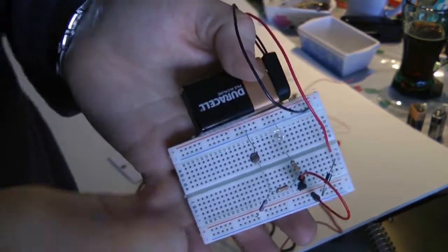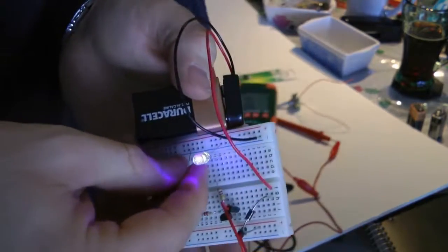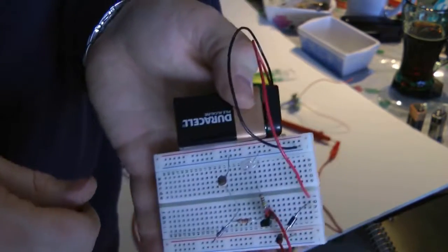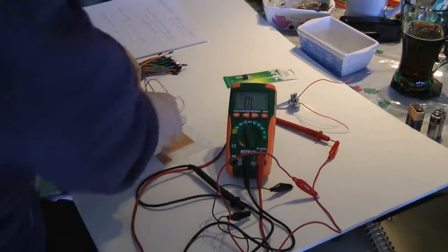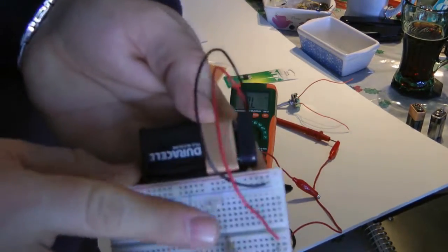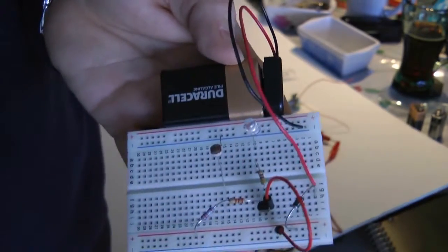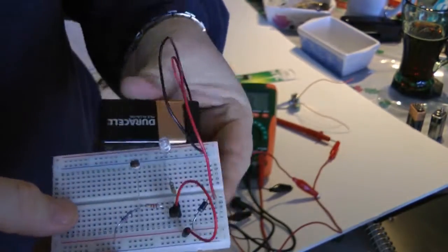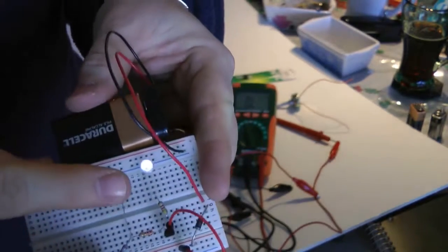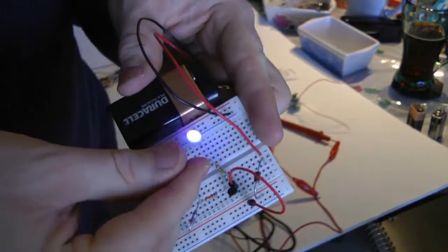But what you could do is take the potentiometer and adjust it to wherever you want this night light, and then just put in a resistor. Unless you want an auto-adjusting night light. You can also buy project cases and build it into a case and everything else. And we don't necessarily have to use a 9-volt battery. We could plug it in and have a 9-volt power supply for it, depending on how elaborate you want it to get. But this is the first circuit.